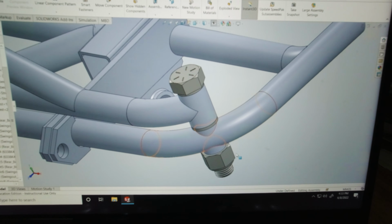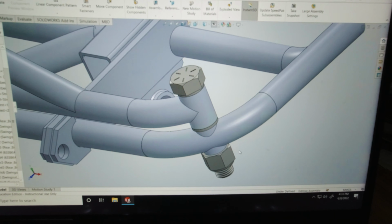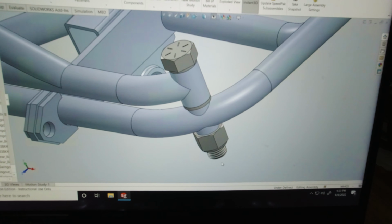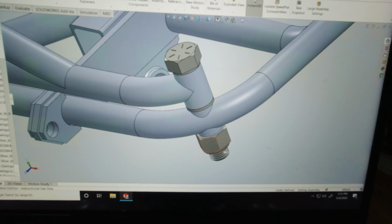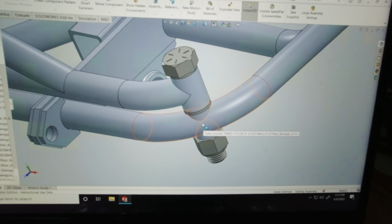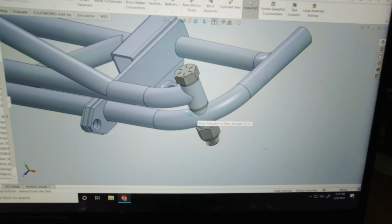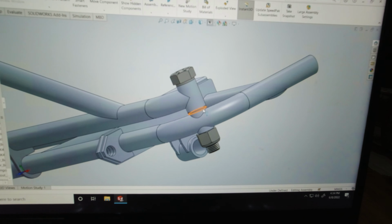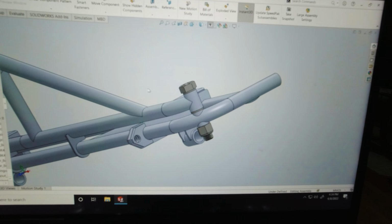This is a 1 1/4 inch grade 8 bolt. Not your traditional hinge hardware, but I think it's going to work out pretty well because I can adjust the swing resistance by just cranking on that lock nut a little more. And a 1 1/4 inch grade 8 bolt is going to be so stupidly strong that I'm just never going to worry about it. I have a couple of brass bushings in here in the Swingout barrel sleeve thing.